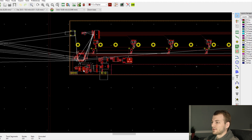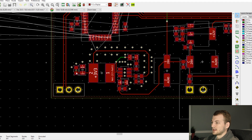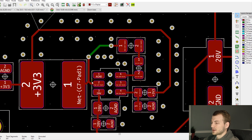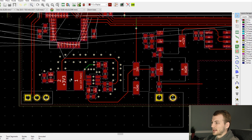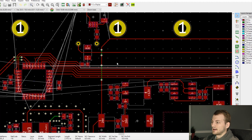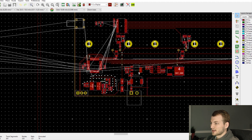After the ADC section, the next thing to work on is the switching regulator. Your input caps need to be as close as possible to the chip, your inductor needs to be close, and the loop from the inductor to the caps needs to be minimized. Any switching loops — right here — need minimum loop area. Ground planes from the regulator chip ground to the capacitors should stay on the top plane if possible. When I start a layout, I do all traces at 8 mil just to get an idea of where everything goes, then expand them to the actual trace width.